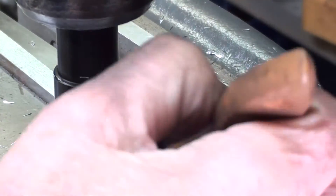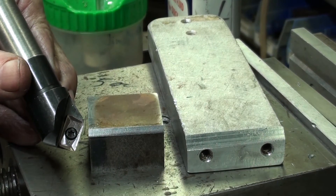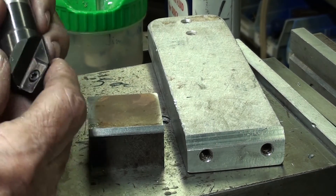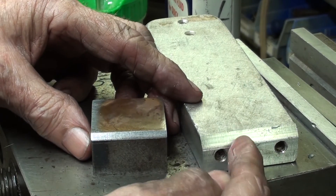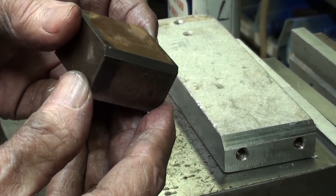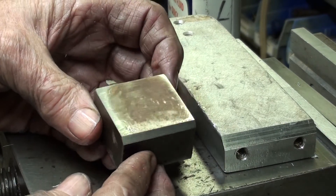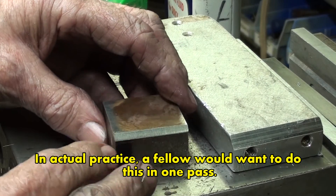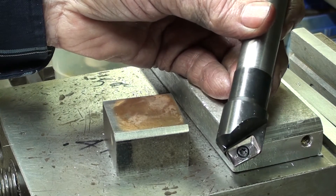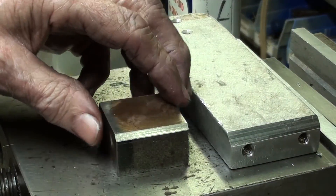Be sure and wear your safety glasses when you work in your shop. It feels pretty smooth. I'm not impressed at all by what it did on the aluminum, but the steel is pretty darn good — you can see machining marks, but I guess that's normal. The aluminum chamfer is about a quarter inch, which is kind of a heavy cut. The steel one is only about an eighth of an inch and it looks pretty darn good. A fellow might go all the way around his project. It would be a good tool, and I hope to use it in a lot more videos — it just sat in the cabinet and I never got around to making the video. Thanks to Banggood for that, and I had to cut the shank down, of course — so that was the detour.